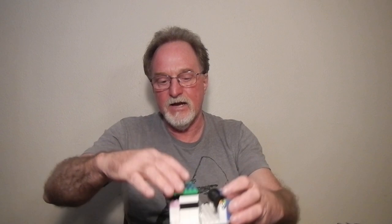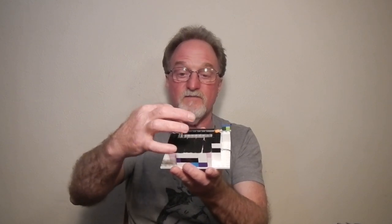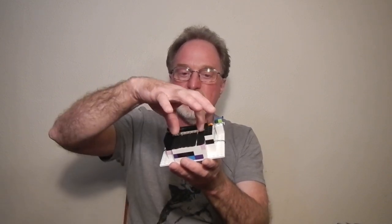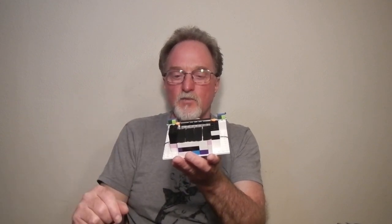The height variation was still pretty bad. So for version 3, I'm going to move the cutter portion and add a take-up spool mounted at the side. Because having the spool here and pulling it through is where I got so much width variation — working in the dark bag, I might pull this way or that way, so the film had latitude to move back and forth. I'm also going to bring the guide down with felt or narrow Legos so there isn't as much slop with respect to the width of 120 film.